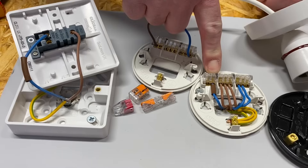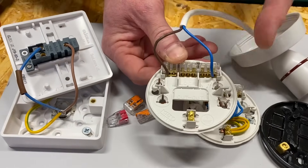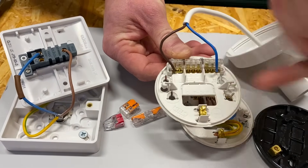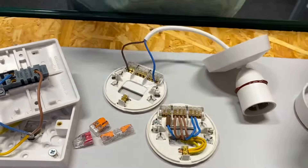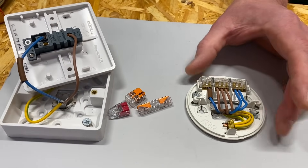The switching line appears at the ceiling rose turning the lamp on. For our flex connections we'll have a neutral on one side and our switching line conductor on the other. If I look at a batten lamp holder, it's neutral on one side and switching line conductor on the other. I've taken them out just to make it easier to show you what's going on.